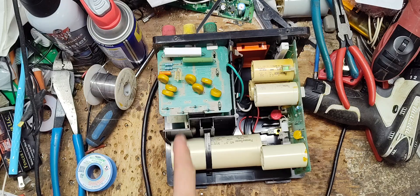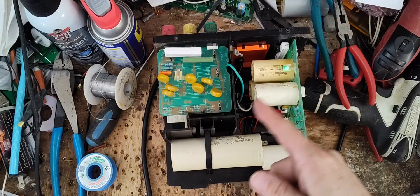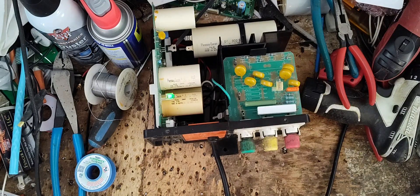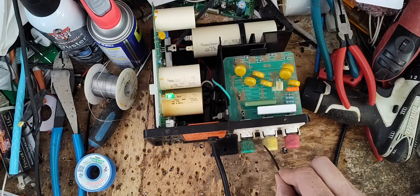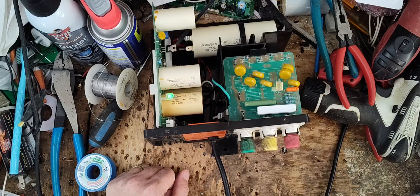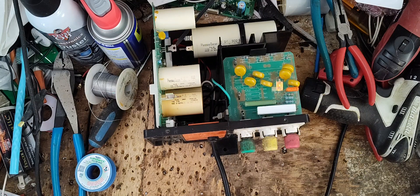There she goes — that green light is flashing too, it burned out a little bit but it's still pretty bright. Let's turn it around. First thing I like to do is a ground fault test, which tests fine. You hook it to a ground system and it tests the windings of the transformer on the output to make sure there's not a breakdown inside. If there was a short, it would still click but the light would go out and get a little louder. With no fence hooked up, we'll now put a fence tester on it.